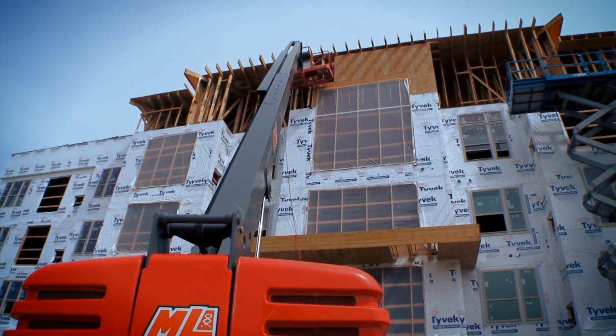That's correct. Again, performance-wise, you have to understand where the moisture is trying to get from, either outside into your building, or maybe you have warm, humid air in the winter that's trying to get outside. So understanding how the building's being used, and what the interior environment is versus the exterior, is an important part of what we look at for the overall wall construction.